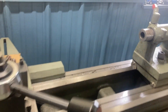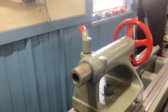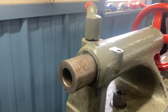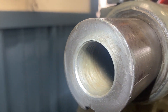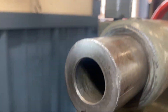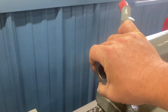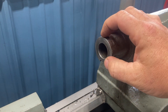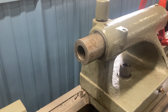What we're doing today is reaming the tailstock. This is a Morse Taper 3 tailstock, and if you look in there — I'm gonna get a light and show you so you can see better — you can see that this taper is pretty worn. Every once in a while, depending on the operation I'm doing, the drill chuck or whatever's in the tailstock will spin and slip. Sometimes it slips a little bit, sometimes it'll completely spin in there. It's been an ongoing problem.